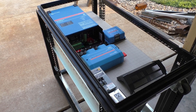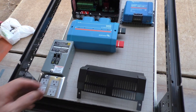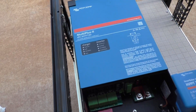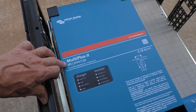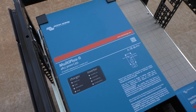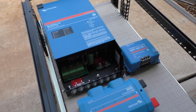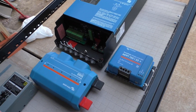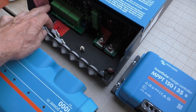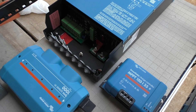We decided to lay the rack over on its side to make it a lot easier for laying out parts. This is where everything ended up getting mounted — this is the bottom of the inverter. What we got for an inverter is the Victron Energy MultiPlus 2 — it's a 48 volt inverter, 3000 volt amps, and it has a 35 amp charger in it. Along with solar charging, we'll also be able to use a generator or any other AC plug-in source to charge it up. You've got terminals for battery hookups, power out, auxiliary power outs, and all kinds of control slots for various features.